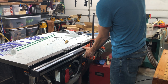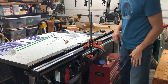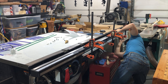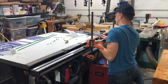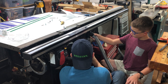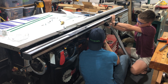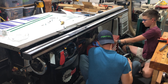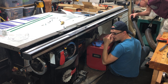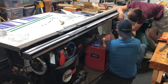So next I'm using some clamps to clamp it to the base after I've drilled them. I'm going to make sure that the distance is right, then take a little Sharpie marker and mark the holes I've pre-drilled on the bar to then drill on the base of the rail for this Saw Stop. I was afraid that this Saw Stop tubing was going to be quite thick and difficult to drill, but it actually turned out to be fairly easy to drill.